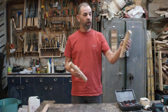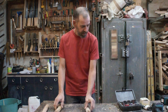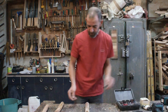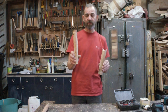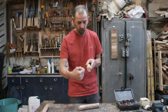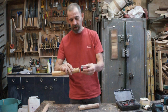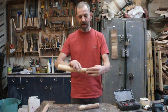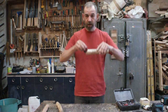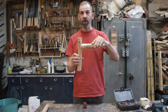To make this kind of joint where this stick hugs the other stick, you're going to need some hole saws again. If this is your upright and your horizontal is joining it like this, you want to find a hole saw of about the same diameter as this stick. I can see that this one's about the same diameter — and about's enough. So with a hole saw you can drill the end of this stick to make it fit this stick, and I'm going to show you how I do that.